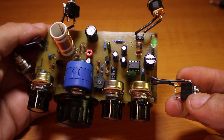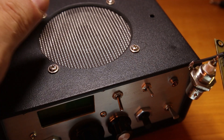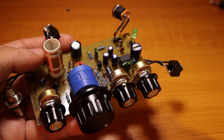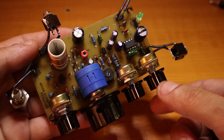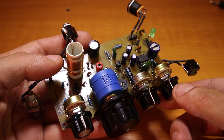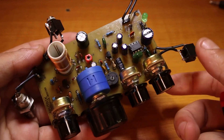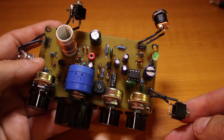The original schematic was made for headphones. In the modified version I got complicated and built an audio preamplifier and a bunch of other things just so I could use an external speaker — which was great — but honestly I stopped listening as much because in my living room I have family coming over and I don't want to bother them. So I designed this one back to headphones, which also gives lower battery consumption.